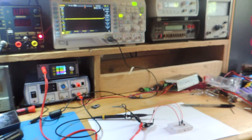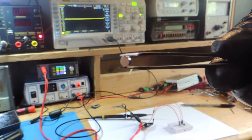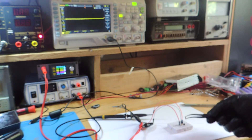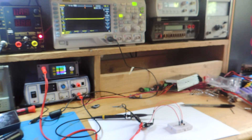Now we have all the cables connected. I also connected the oscilloscope to the signal and ground pins. So let's use some neodymium magnets to see how the Hall Effect sensor detects their presence. As you can see, when I approach the magnet to the Hall Effect sensor, we see the variation of the voltage in the signal pin of the Hall Effect sensor.